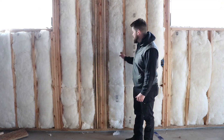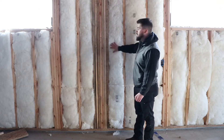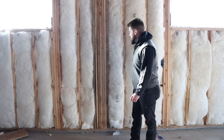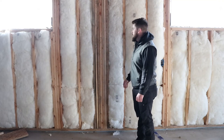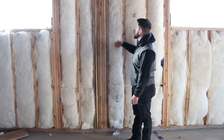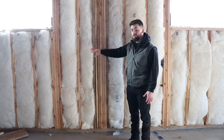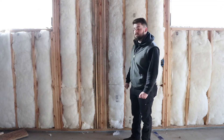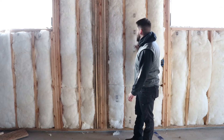Today we're standing in front of what's going to be the most budget-friendly, cheapest option Kinsler offers — fiberglass batt insulation. This is a two-by-six cavity, so we can fit a piece of R19 to R21 batting. This is more of an air-filtered insulation; it doesn't stop the air but it will help filter it. We're in a garage right now, and we've decided to go with fiberglass batt plus a four-mil poly on top. Air does infiltrate through it, but it's a great budget-friendly installation.